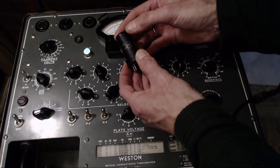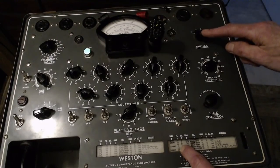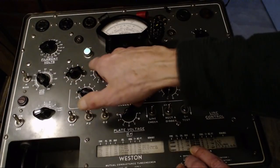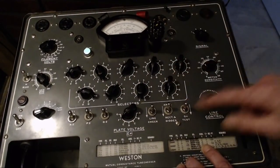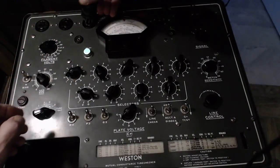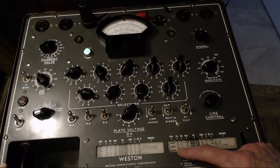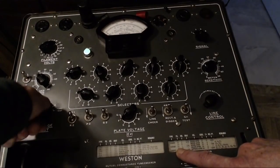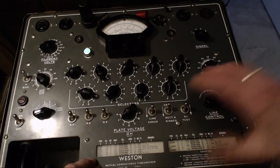Okay, we're ready now for the 12SQ7, 13, signal level 1, 18L, 25100, 3760, 37, right on, pop them in. Heard a little click there. So of course this is the detector tube, so the first thing we're testing is the triode amplifier in it. No shorts. This triode amplifier should show up at about almost 800.